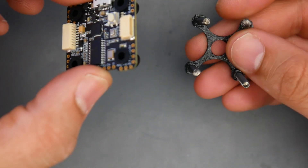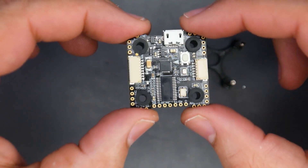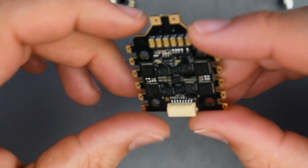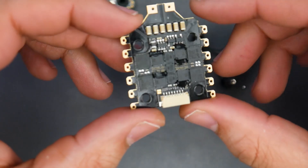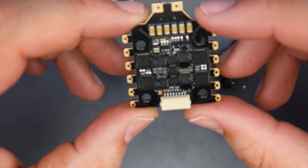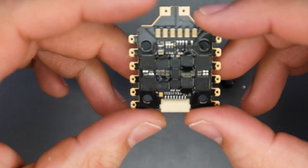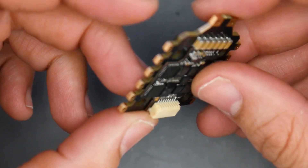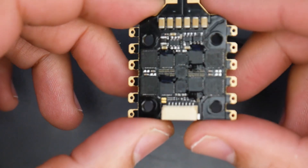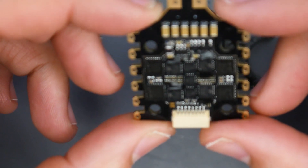I was planning on putting this on my upcoming build, but I need to find rubber dampeners that fit M2s — otherwise I won't be able to place it on my upcoming iFlight build. However, I would really love to use the ESC. Talking about the ESC: it's rated up to 45 amps, BLHeli32, using F3 microcontroller units. Filtration is pretty decent for a mini stack. Not only that, the power board is separated from the logic board, which is a design that's proving itself very reliable.